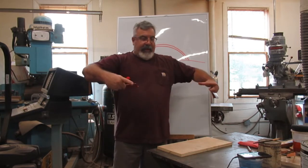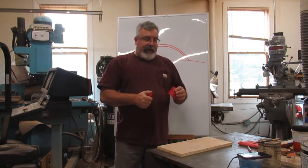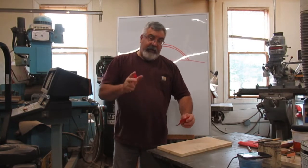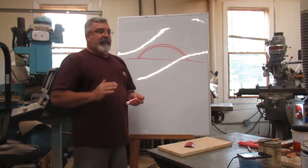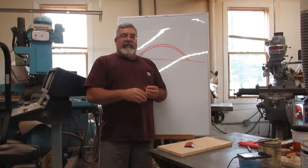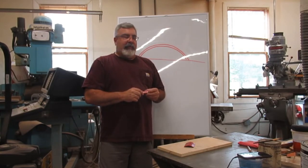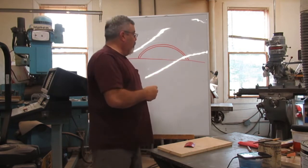If you have a 1/8 inch thick pattern that big, there's no way you're going to cast that in sand casting. Some people might be able to, I wouldn't be able to, because there's so much surface area of sand in there, unless you heat the sand up beforehand. Otherwise the aluminum will just start chilling and you won't fill it up.